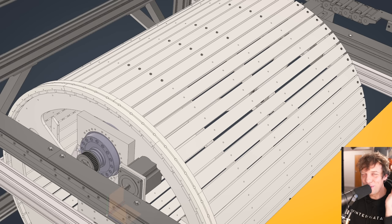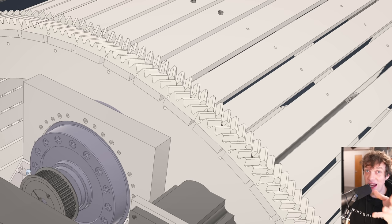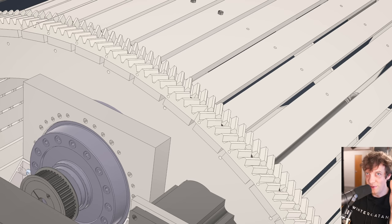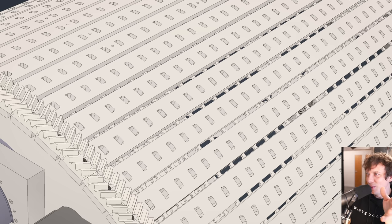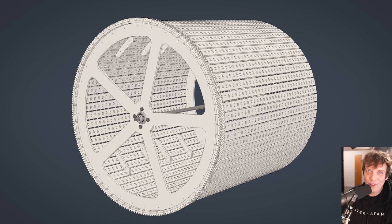We're heading back to the rotary lathe and mounting this whole beast. We're going to design the lathe so we can lower and raise the rotary axis, so my CNC machine can work on any thickness material — it's designed for the purpose of making this wheel. And then we're going to make one of the most beautiful features I have ever dreamed of: the double helical gear. Some people call this a herringbone gear, but when there's a slot in the middle like I have, it's actually a double helical gear. If we manage to trim this rotary axis to perfection, this helical gear will be butter-smooth perfection — concentric and perfect. It's machined around the axle it will actually sit on in the machine. Last but not least, we're machining the programming holes on the rotary in place, which should result in very, very perfect programming holes. And that's it — we have machined and manufactured our brand new programming wheel. I hope you love it as much as I do. A beast of simplicity and complexity.